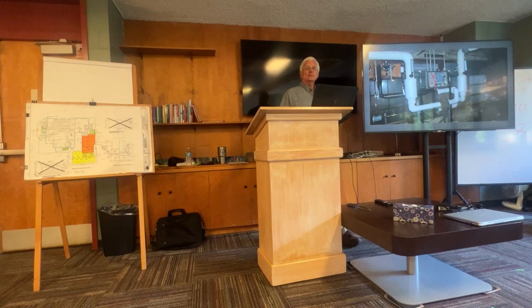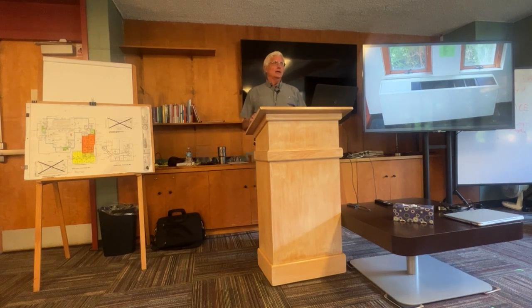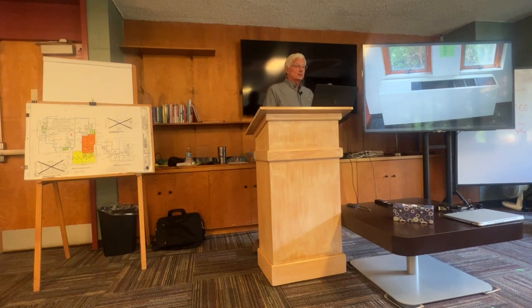All of that is underneath the stage — there's a mechanical room under there. This is the typical console unit in the offices and classrooms. We're starting into generation three of these. The compressors go out and it costs more to replace the compressor than to buy the whole unit. The Freon has also changed — the older units used Freon the EPA won't allow anymore. That was also the case with the old chiller, which had so many leaks due to outdated Freon.